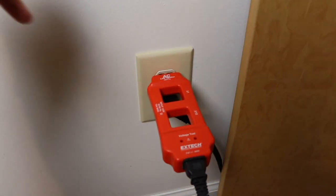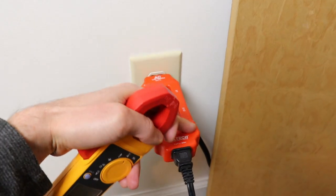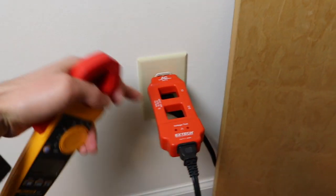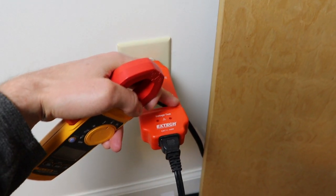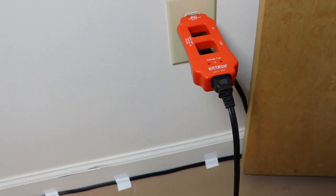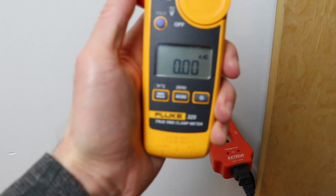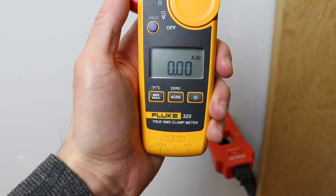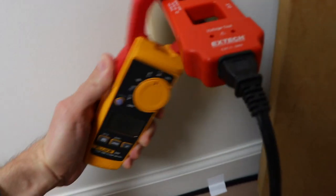So why are there two spaces in this line splitter? One side comes straight in and goes straight through and out. The other side comes in and loops ten times around that square. That allows us to get a more precise reading on our meter — we only have two decimal places, but using that second square gives us a bit more precision.